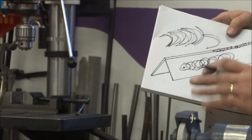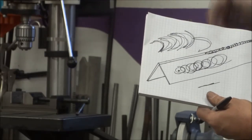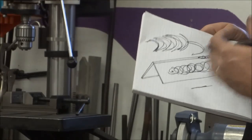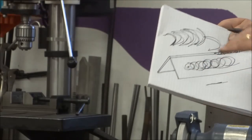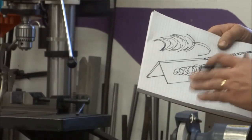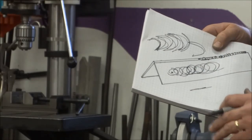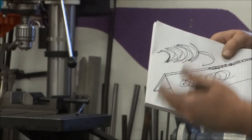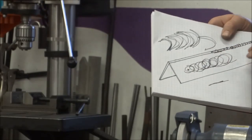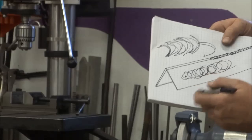If I have a slight gap to fill, again, I don't like to fill gaps. I try to be disciplined in getting my fitment tight. That's first and foremost. Get your fitment up. It's like building a house. Everybody's going to build on that foundation. And if your fitment is bad, you're going to struggle. Even for an experienced welder, I've had some gaps that I've had to fill out in the field that are less than ideal. And if you're trying to learn, you're just compounding that problem. So fit your parts well, tack them good, and then concentrate on welding rather than filling gaps. So fit your parts up well, practice on welding.